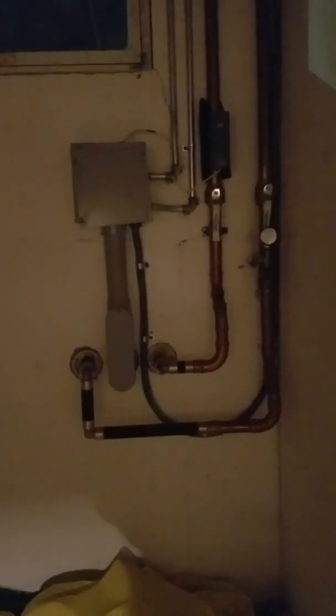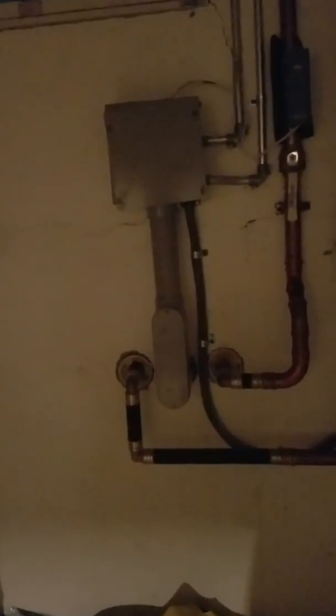I was thinking about using a Tekmar controller but I didn't need to go that complicated. What I have here are the supply and return lines coming in underground into my basement. At the junction box I'm feeding 100-amp service out to my detached garage. The supply line coming in is an inch and a quarter PEX line sleeved through a schedule 40 3-inch pipe, and I spray-foamed it. It's very important that you have really good insulation around those lines — that's where you can really burn a lot of extra wood if you don't have the right insulation value.